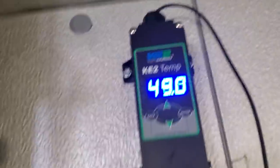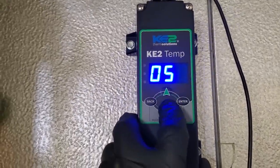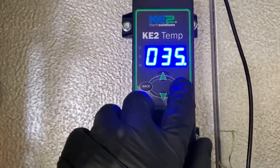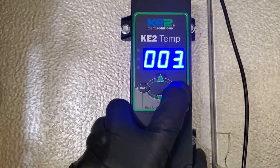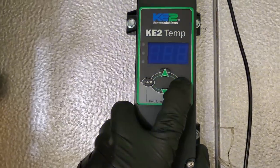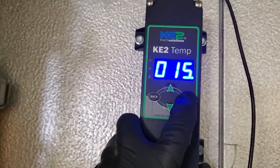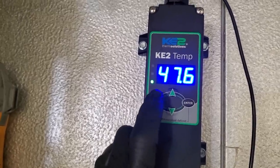It starts in a defrost. Evaporator fan motors are on. We're going to set T5 down to 35. Differential down to 3. Compressor starts per hour — we're going to change that to 0. Defrost per day — we're going to leave that at 6. Defrost time — we're going to leave that at 15 minutes. Everything else is alarms. Solenoid valve works. We're on and running — now I just need to clean some things up.